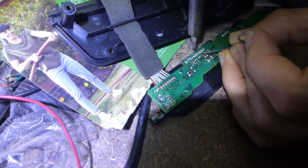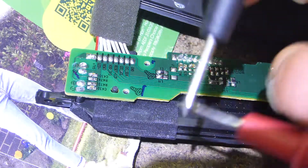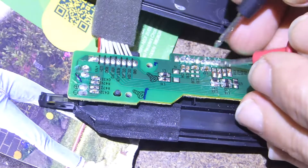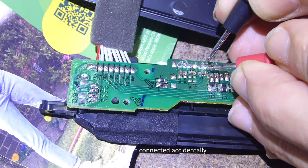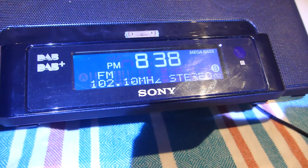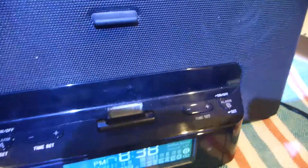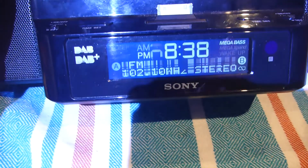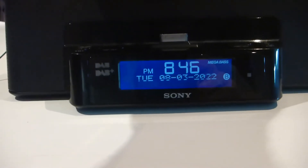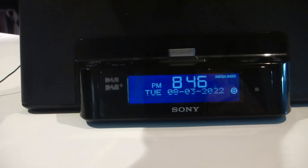You just have to be super careful you don't overlap joints. I'm going to use my multimeter - hear that beep - going along each of these pins to check that my soldering hasn't bridged any of the pins. Nothing looks problematic - a simple check, because if I accidentally soldered those together I'd be stuffed. And that is vastly improved - still got a couple of lines across it, but it's entirely readable at full brightness. Nice.